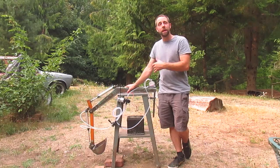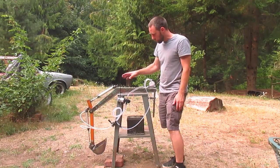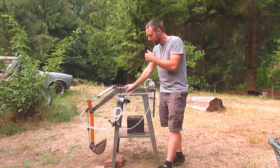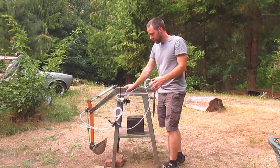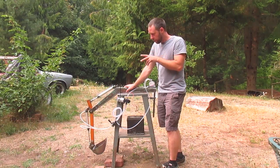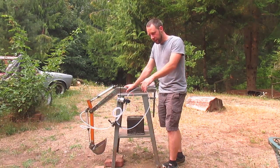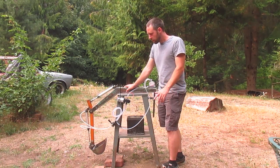I had some pneumatic cylinders and was working on a pneumatic system for my son's excavator — one of those gravel sandbox excavators, but taking it to the next level. It's probably going to be a year before I'm finished. The problem with the pneumatics, even with needle valves to slow them down for nice smooth movement, is that if they got hung up under some gravel they'd fling up really fast.